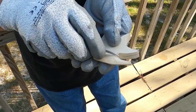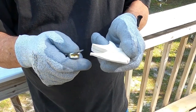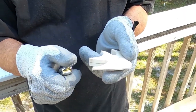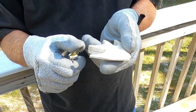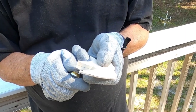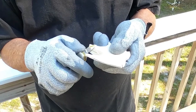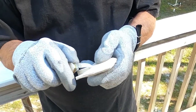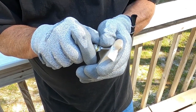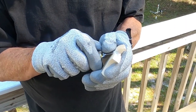When you get down to a little corner like right here, you can make use of a stop cut at the bottom of it. The most important part of your knife, I think, is the tip — maybe the first three-sixteenths of your blade; that's what you're really doing fine work with, and you've got more control. If I'm going to thin that down I'm using a push cut, getting right down to that flat spot, using just the very tip of the blade. Remember, we're going to clean this all up and finish it off with sandpaper.